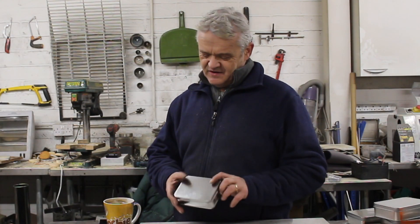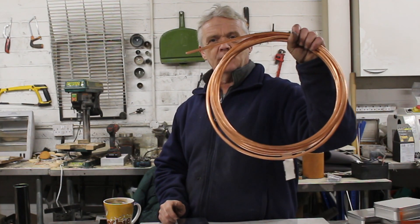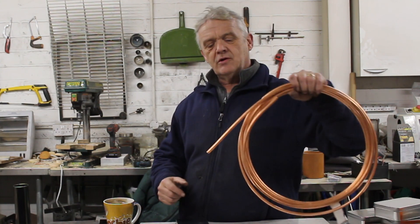So I thought I'd design a burner that had a liquid reservoir not exposed to the flame. First thing, we need a tin. I found this with a Christmas gift in it - it was a horrible Christmas gift, only a couple of quid - but it's a stainless steel tin, flat and square. That's going to be the basis of our burner because it closes gas tight, which is pretty cool. Then we're going to need some micro-bore copper tubing, 8mm outside diameter. What you need is four 2cm sections.